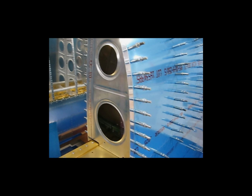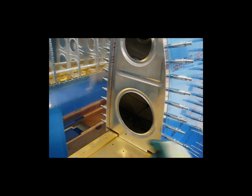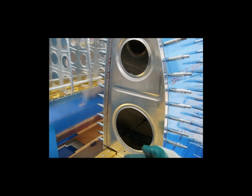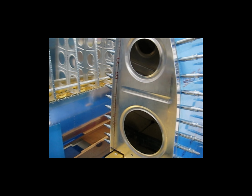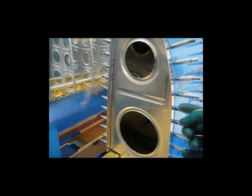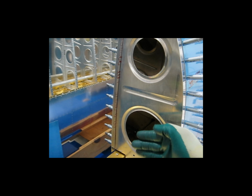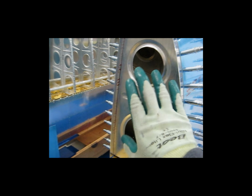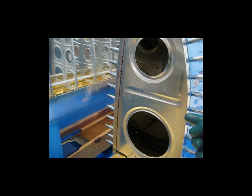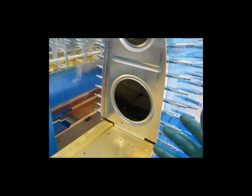Again, I liked it better that way because with the instructions, you fit the rib, which has not been fluted, because you don't know where the holes are going to be, right? When it's a naked rib, there are no holes in it, and it's bent from the forming process. They want you to cleco it here, put it in place, fit the strip in between. You line the line with the strip with the holes on the skin, but you have no way of knowing where the rib is, especially with it being bent. It would be very difficult to wrestle with trying to get the rib straight, trying to keep this lined up, and then drill your holes, but you don't know what your edge distance is going to be with the rib because you can't see. It's just, to me, it was just cumbersome.